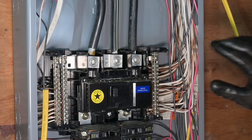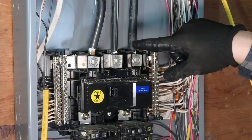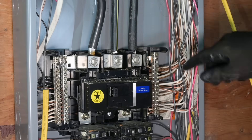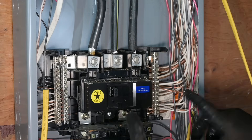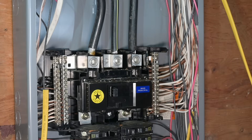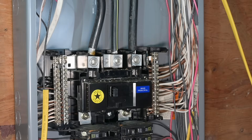Here is what I mentioned earlier — we still have power coming into the panel. This is one leg of 120 volts, and this is another leg of 120 volts. My finger is at least six inches away from these. Between those two legs is 240 volts, and that center one is the neutral. Those terminals are going to stay hot the entire time. Some newer panels have little covers over those, but this one doesn't, so keep that in mind. Treat everything as if it were live — similar to firearm safety, always pointing in a safe direction.